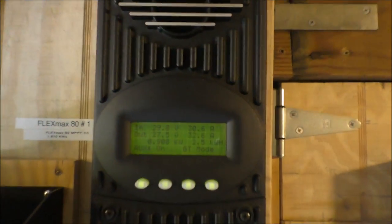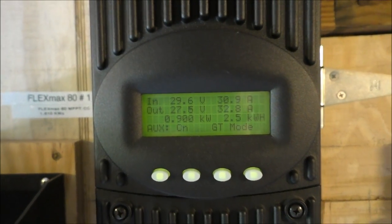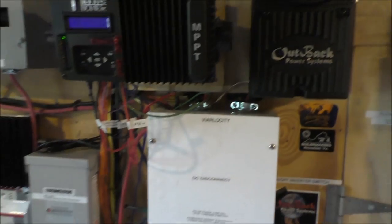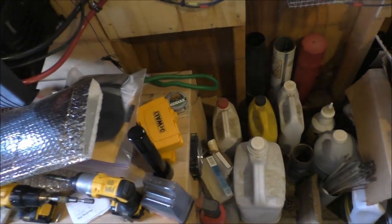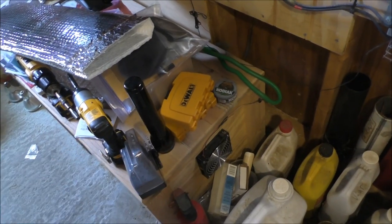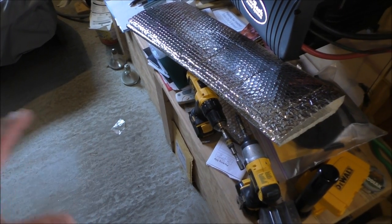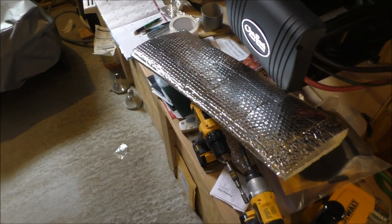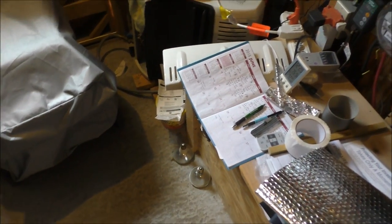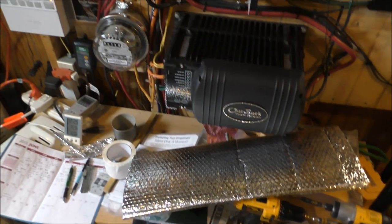The batteries are down low — my battery bank. I've got my fans going and they're running from my Outback auxiliary port right here. That fan is drawing that cold air off the floor into my battery box, and then the exhaust comes out on the other side. So the batteries act like a cooler — it also keeps the building cool because the batteries are a big mass of lead. The cold air goes in there, keeps the batteries cool, and the cold air comes out of the battery box. It's working out good.